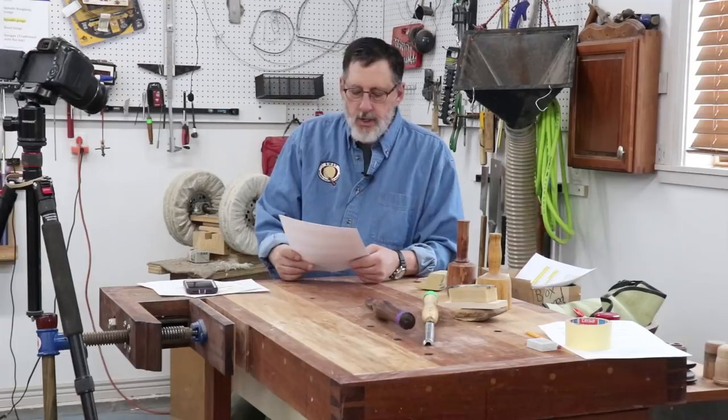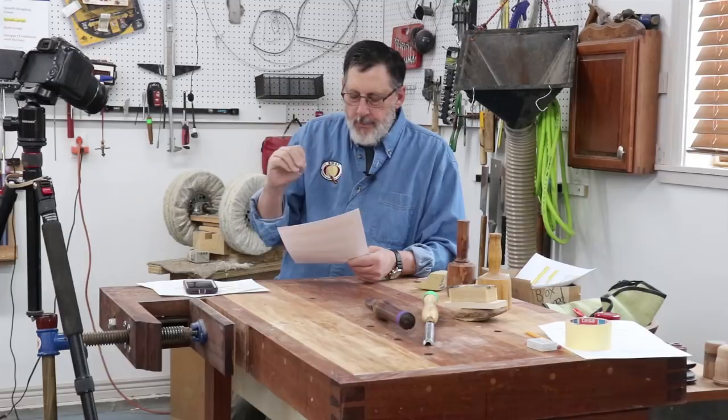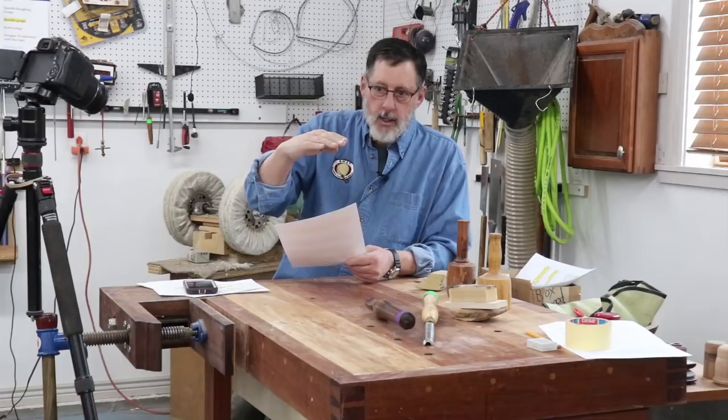Randy Jones has a really good question about scrapers: 'Just to make sure I understand correctly — the being above centerline inside and below, etc. — is it the cutting edge or the tool rest?' Ordinarily when a woodturner explains that, it's the cutting edge. You want the cutting edge above centerline, or you want the cutting edge below centerline. So that's kind of where we're at there.